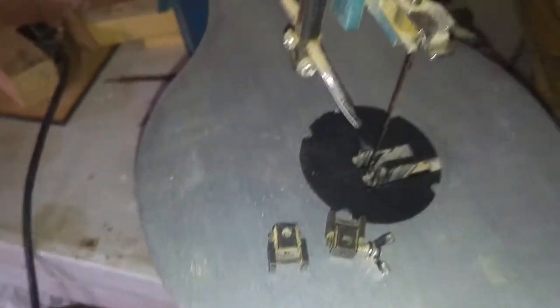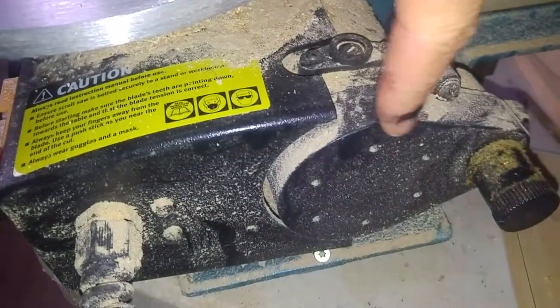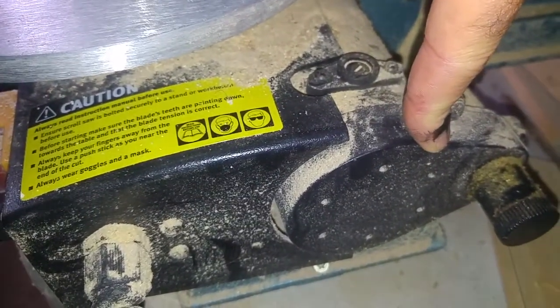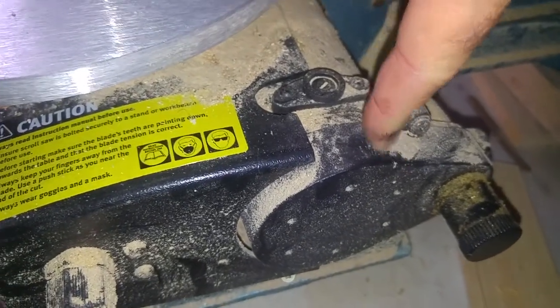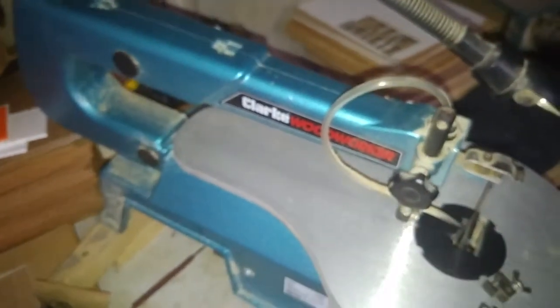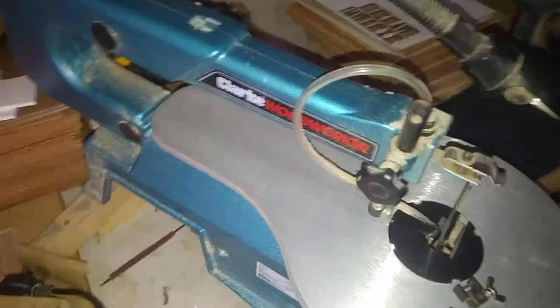The scroll saw has been a good little bit of kit. I did have one issue - inside there's a little rubber belt that drives the worm drive and it broke. But I got in touch with them and it was only about £4 or £5 for a new belt. I think it was my own fault because I left the worm drive in all the time, so it was driving constantly - and after over 12 months of that it just wore out.